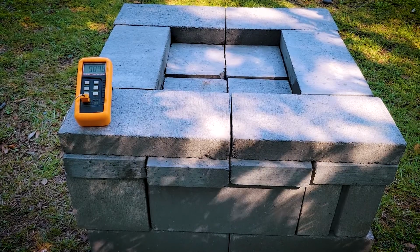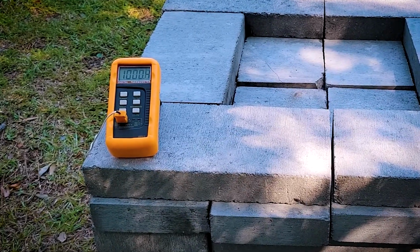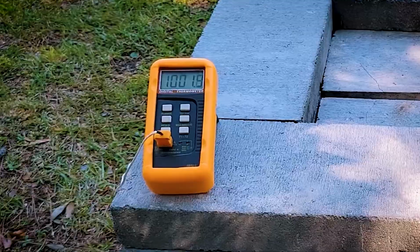Hit 1000 degrees, actually got up to 1050 degrees and had to work on cooling it off a little bit more and really just fine tuning in that 1000 degrees Celsius number. It's so hot that everything is really delicate. You change one thing and you might be off like 40 or 50 degrees, but I got it to balance right in there, plus or minus like 20 or 30 degrees. It was awesome. I think another really big thing to note is that as it's heating up, there's a lot of temperature instability, and after about the 10-minute mark, things kind of evened out a whole lot more.